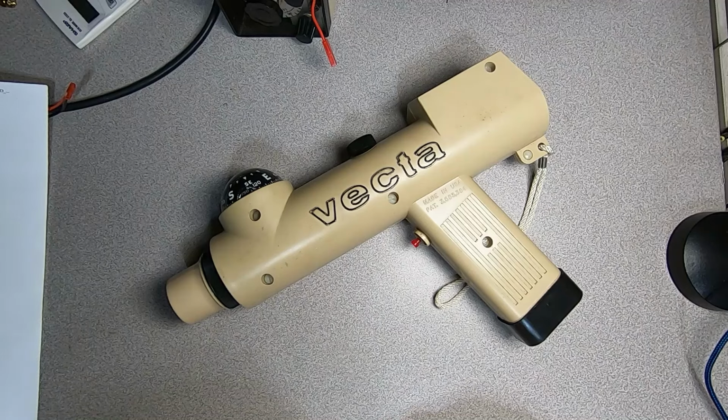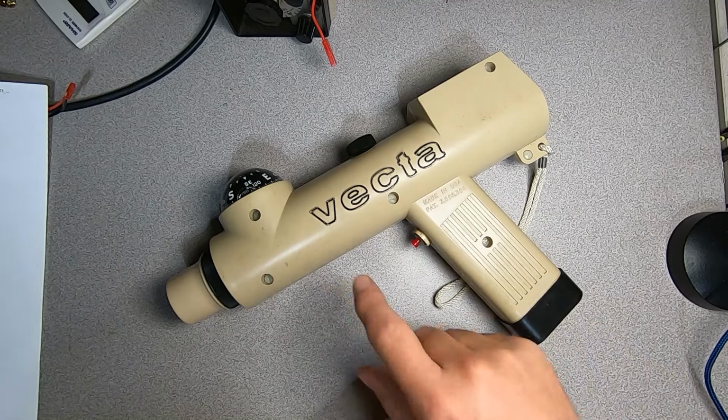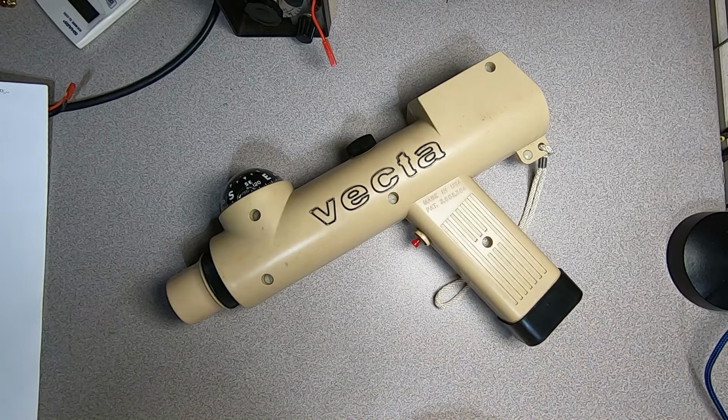I do not have any AM broadcast band modules to test this theory, so we need to open our device up and inject a modulated 325 kilohertz signal. To open our device, we need to remove the battery cap and the nylon fasteners that hold the housing together.